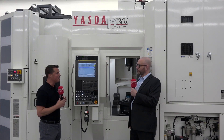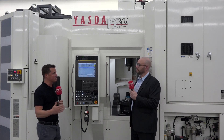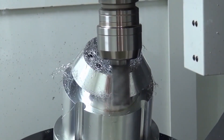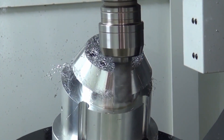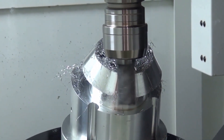Balancing the tool makes a really big difference. When I think about the importance of balancing, I think about the investment to make sure that it happens, and then immediately think about the tool loss — 10%, 20% tool life that's lost if it's not balanced. These things can easily be paid for because we've had customers pay off a balancer in a period of weeks, because they were not able to use the full capability or capacity of the machine.